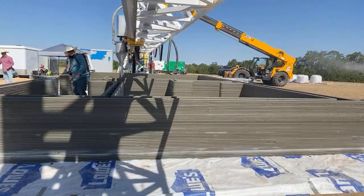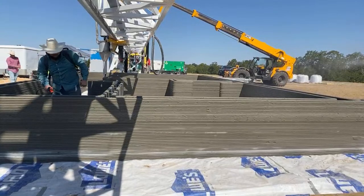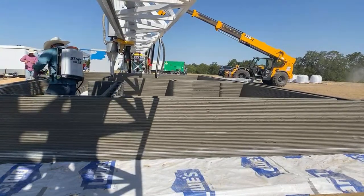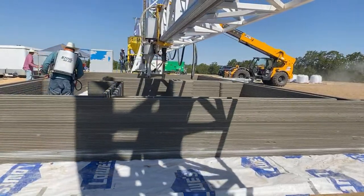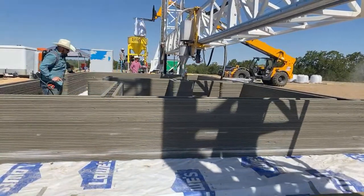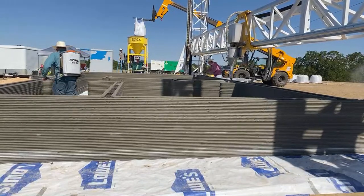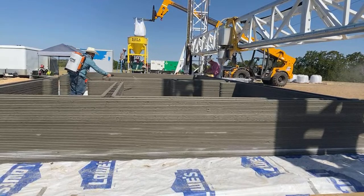We were talking about the different things you keep an eye on, like the hopper level, the way the material's coming out, if it's homogeneous or not. So keep an eye on the current head hopper level. We'll keep an eye on how the bead is looking, if it's stretching, if it's compressing, if it's sloshing over the edge. And we try to compensate with what we can by adjusting the print speed or the extrusion rate. Just to do the best we can, because the issue is we're not in a controlled climate, right? So you can't just set it and forget it. You gotta keep on your toes and keep it adjusted.